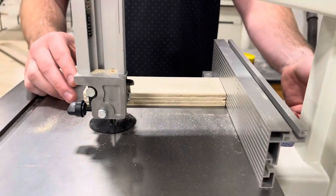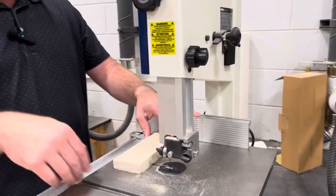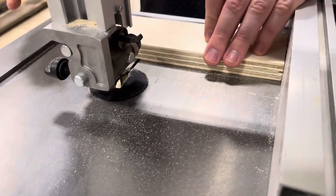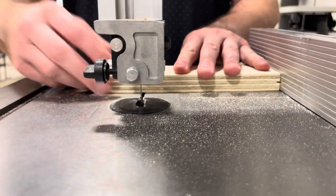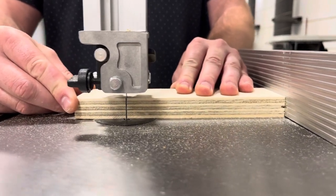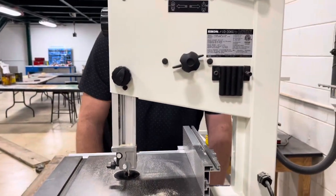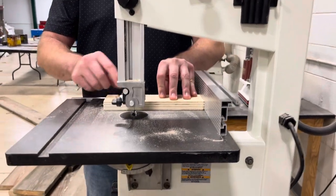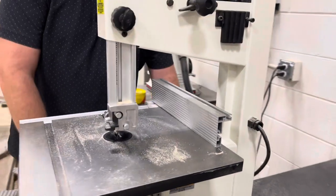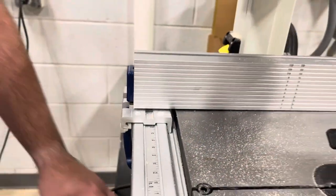Let's go ahead and make our cuts. Over here is the power switch — I'm just going to pull it up to turn it on. I'm going to let the blade come to full power, running at its optimal speed, and then I'm going to push this piece of wood through the blade. I'm not forcing it; I'm letting the blade do the work. I put one hand here and my other hand over here, keeping my eye on that part. I can keep pushing through and bring the wood back this way. That was one six-inch cut. Remember: we don't make any adjustments to the blades or blade heights until the machines are off.